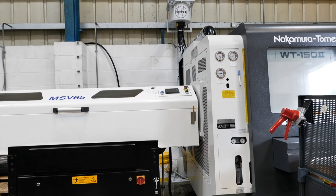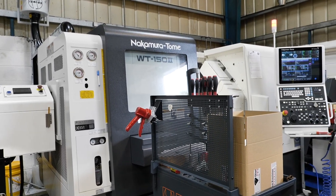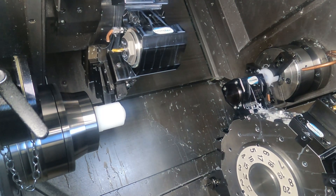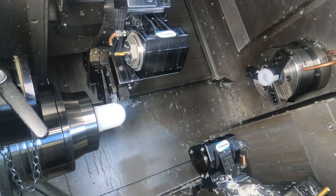Talking about plastic and different materials — this creates really stringy swarf. Is there anything you've implemented to cut the swarf and evacuate it properly? The machine has an application specifically for breaking up the swarf — it judders as it goes along and makes the swarf smaller, so it's easier to cope with and easier for the machine. Really handy for keeping it going.